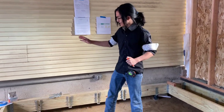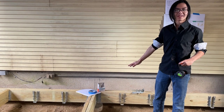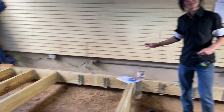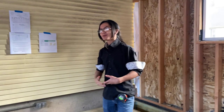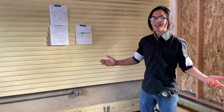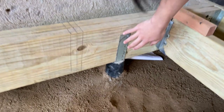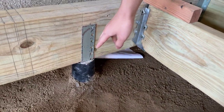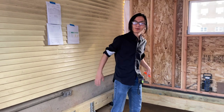In our last video I talked about how we're laying down the footings. These footings go down 42 inches and they have concrete in them. We planned to only lay six footings. However, my dad was thinking that during parties, kids might come in here and there might be tons of kids dancing in this room, so the floor might not be able to support the weight. He decided to add another footing — this one is actually made of metal instead of concrete, right here and over here as well. He added those additional footings just in case the six footings we already have could not support the weight.